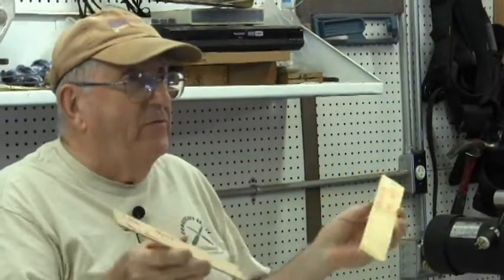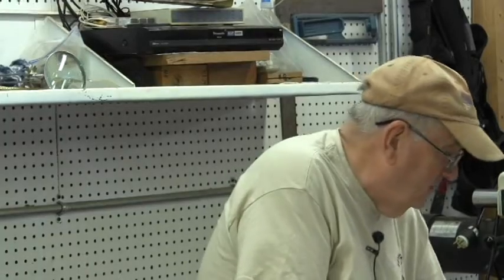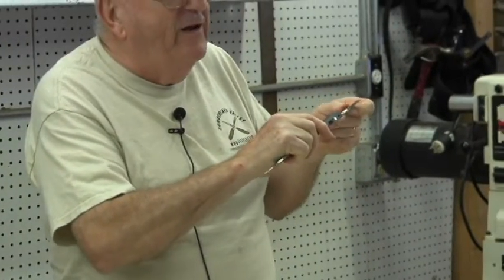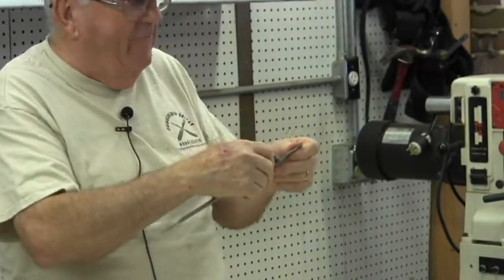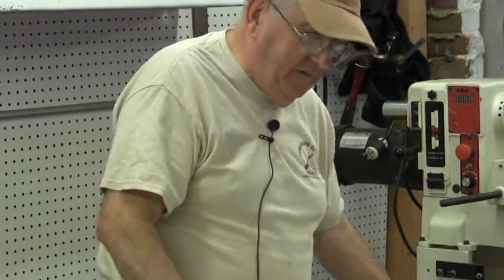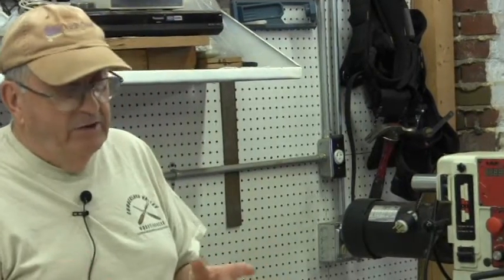I keep these so if I go back I don't have to remeasure this thing, because getting it at 1.696 with this seems real simple until you try to get to the 0.6. You play with it for 5 minutes to get it where you want it because it moves pretty rapidly. But this is something you have to have if you're going to go this route. So all of this was done to this point, whatever the measurement.